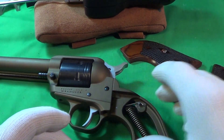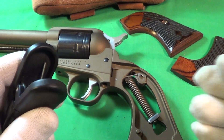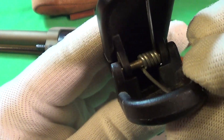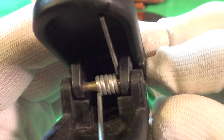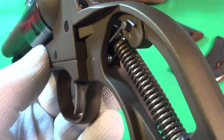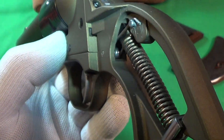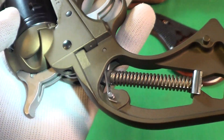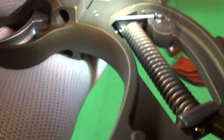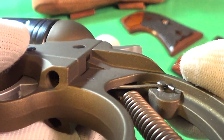One thing I found in the owner's manual: it says the owner is allowed to adjust the trigger if you don't like the five and a half to six pound trigger pull. This is an example of what this spring looks like — you can see there's a leg, it goes around that pin, looks like about four or five turns, and comes out the other side. So it goes in and around that pin right here, and attaches to that mushroom post. It's mushroom shaped, so that spring leg won't slide off.